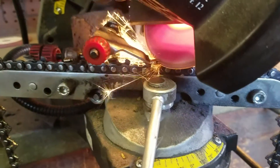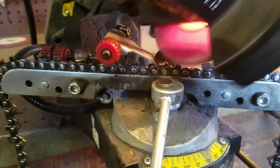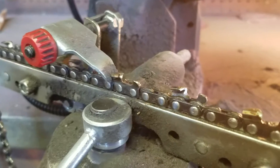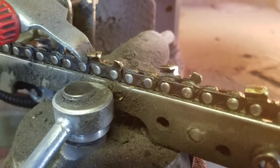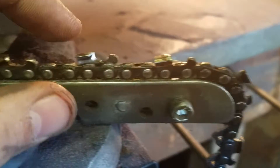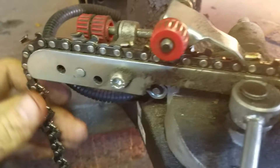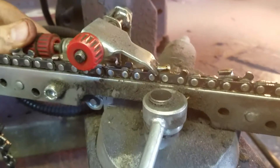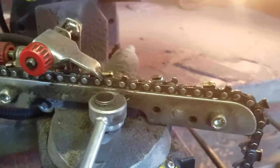This one's a pretty rough chain. Let me work on this for a few minutes and I'll show you where I'm at. Okay, so here's after the first pass — I've done both sides already. You can see that nice shiny edge on that tooth. I still haven't done the second pass yet. It's kind of hard for you guys to tell, but the edge has definitely improved. It's not great, but it is definitely improved. So I'll readjust a little bit, go forward just a hair, get the hydraulic lock off, and take off a little bit more.